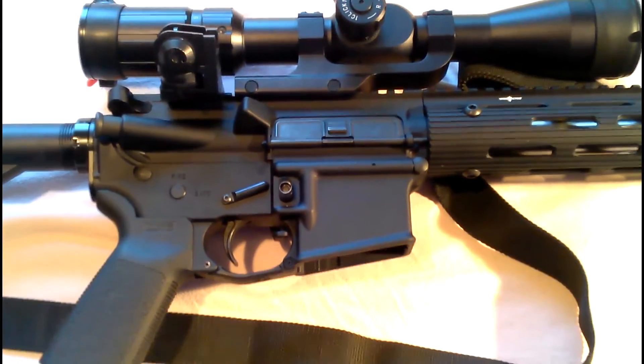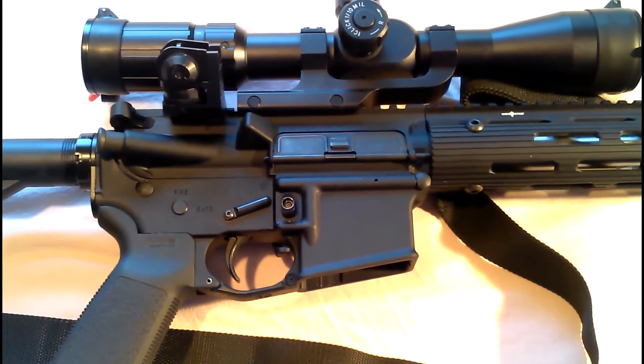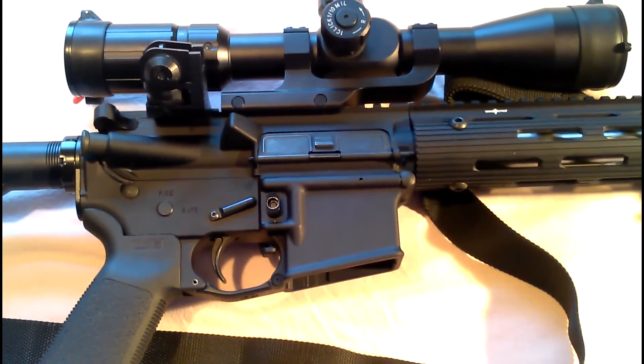It was then sent out to the other company — whether it be Colt or LMT or whoever — for final machining to put the upper into production. Beyond just who forged your upper receiver, you might want to look at that rear takedown lug and try to figure out who machined your upper receiver.